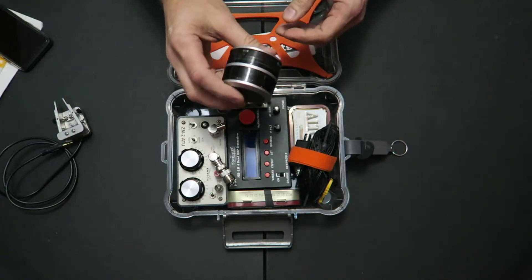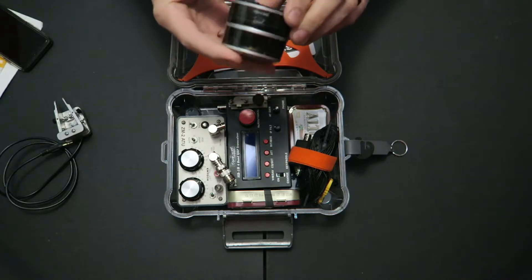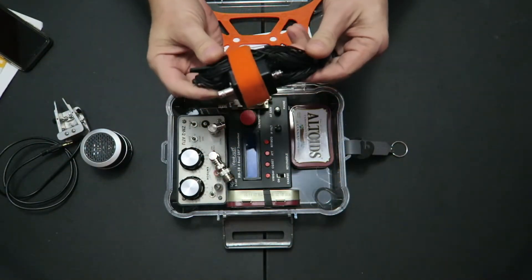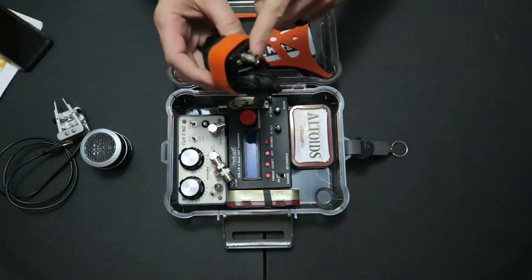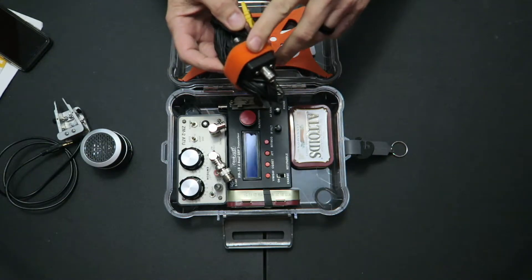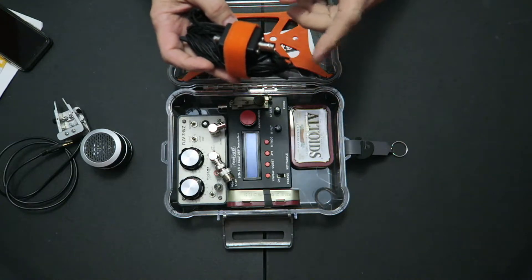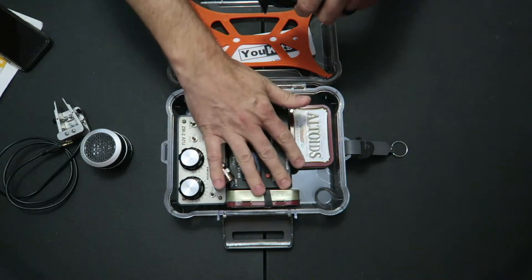This is a speaker — it's a powered speaker, an iHome. It's got the bellows and it expands out. It's USB rechargeable. I have the LNR Precision trail-friendly antenna. You can connect a very short piece of coax to this from the tuner or the rig. I contacted LNR Precision about this antenna and asked about the feed line — everyone's going to tell you the feed line should be as short as possible. I ordered some RG316, a ten-foot section, and I think that will roll up nicely on top of this case. I won't need the tuner with this particular antenna.